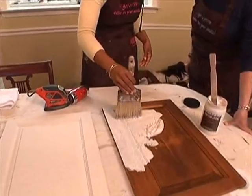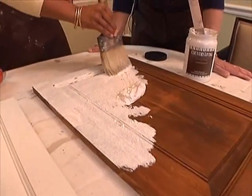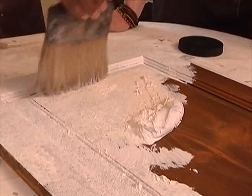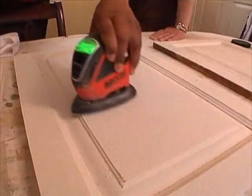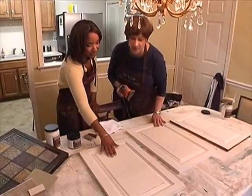It's almost like a mayonnaise consistency — it's much thicker than paint. And that's really the point. You just would not be able to do this with latex paint without sanding or stripping first, because it would be chipping right off the surface. Once applied, sanding it is actually going to make it feel wonderful and give it this beautiful textured look.